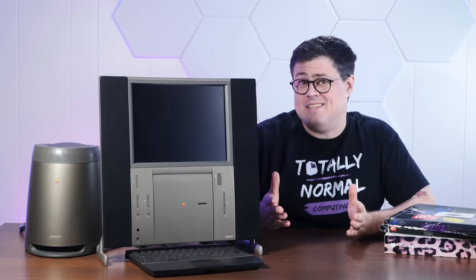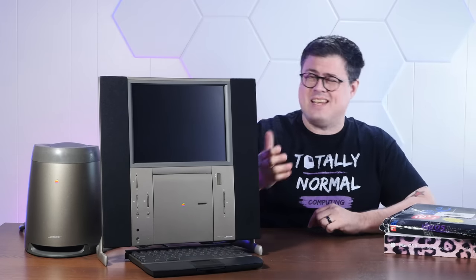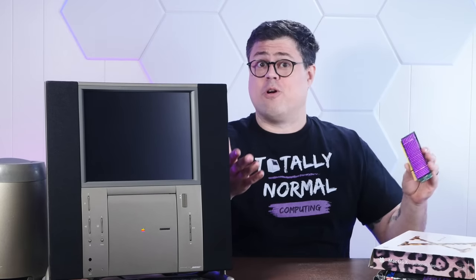The 1997 20th anniversary Macintosh was only ever released with a single processor option, a 250 MHz PowerPC 603E. And although there were a few upgrade cards released for it during its short life, they were weird cache card upgrades that only worked under classic Mac OS, not BeOS or Linux, and crucially, not Mac OS X.